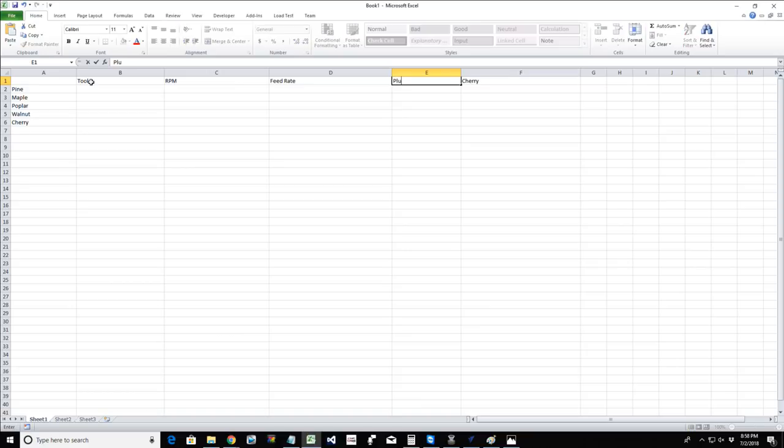Plunge rate, you're just going to have a general setting for your plunge rate, generally between 10 and 20 inches a minute, because that's how fast it's plunging the bit in. But we can have that in there as well too. Now, this is for determining my chip load and things. And so I could have the category of chip load. And pine is a softwood, so that's going to be 0.003